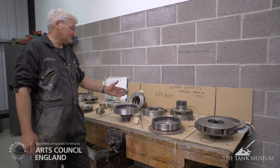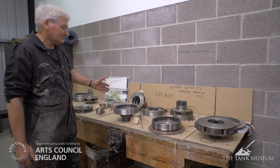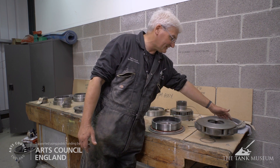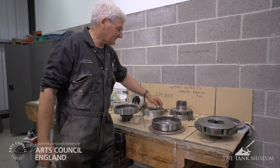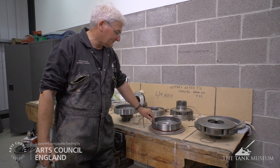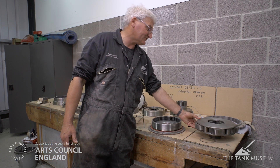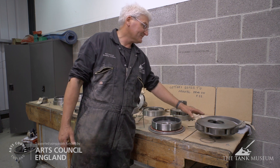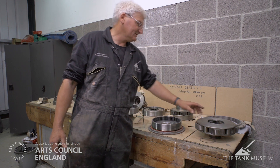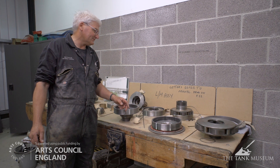The components laid out on the bench here are basically all the gear trains out of the gearbox. It's an epicyclic gearbox, so it basically uses sun and planet wheels — these are planetary gears. You have a sun wheel in the middle and an operating annulus on the outside. On this particular gearbox design, it has a fixed final reduction gear, so whichever speed gear you've selected also goes through this final reduction gear, transmitting power carefully to the rest of the transmission.